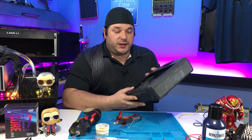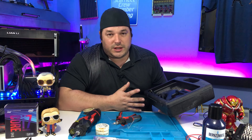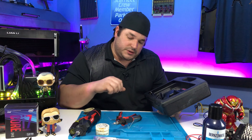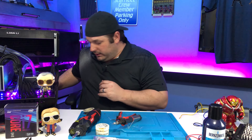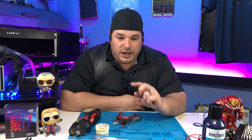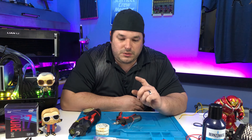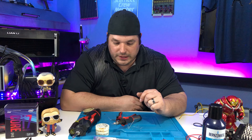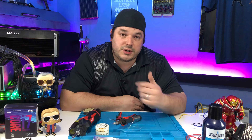This other one is my 100-watt inductive soldering iron. I've used it a lot and made quite a few different tips for it — you just grind them down into different shapes. This one actually works really well; there's nothing wrong with it. They have a reputation for shorting out and being unreliable, but I've had a few different versions, including an antique version older than 20 years that I unfortunately lost. Both of those are 110-volt soldering irons.